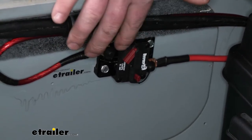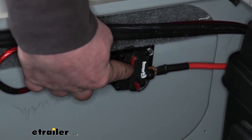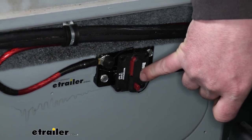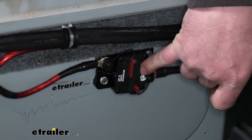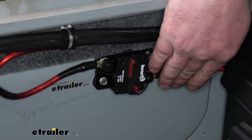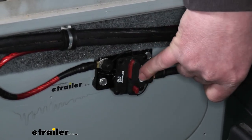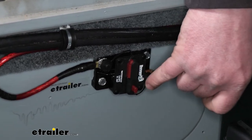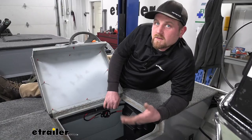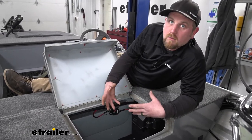If the breaker were to trip, unlike a fuse, you're not going to have to replace it right away — all you have to do is reset it. I'm a big fan of the manual reset for a few reasons. Some circuit breakers are auto-reset, meaning whenever they get too hot, they'll trip, and once cooled down, power comes back. That's convenient. However, if the breaker is popping, there's usually an issue causing that. So with manual reset, the breaker stays open once tripped, giving you an opportunity to locate the problem and fix it.